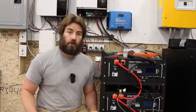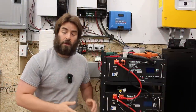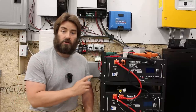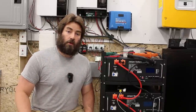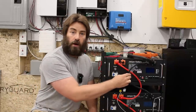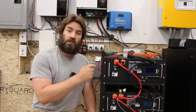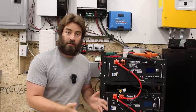We're going to use some extra components I purchased with my own money to make these modifications. We'll take all these wires off, add a bus bar and a fuse, put the wires back on in a new orientation, and run a test to see how much cooler we can operate this rack. The less heat loss you have through heating up wires or jumpers, the more efficient the whole system is — you want that energy stored inside the battery, not lost to the environment as heat.